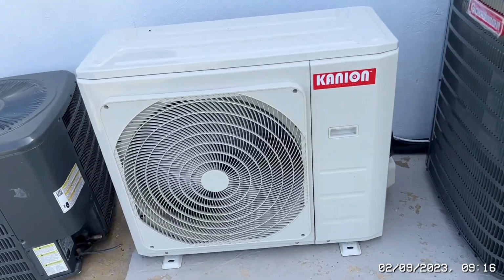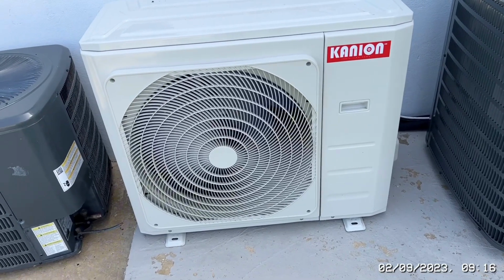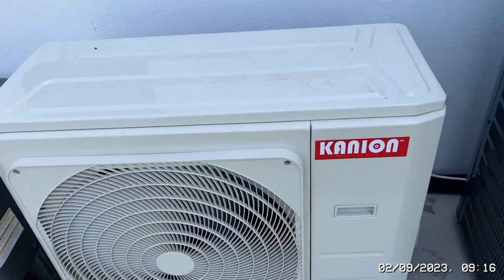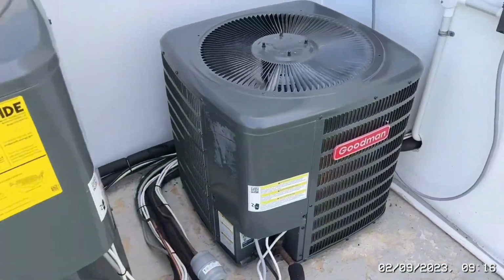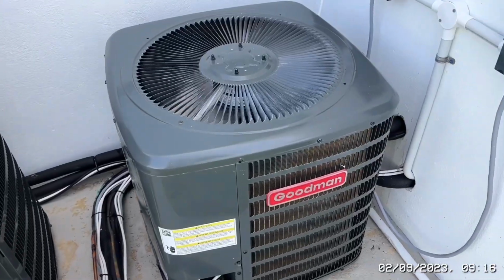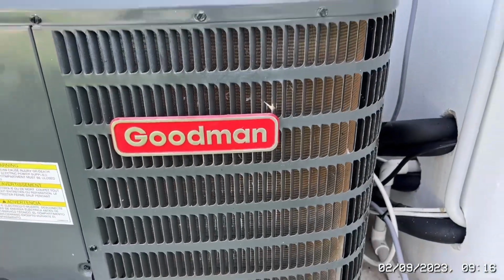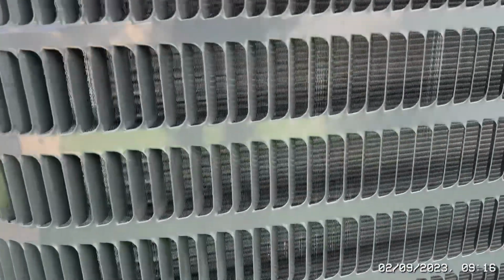This one's running the bedroom, as you've seen before, which is working really well. Word of advice, if you want my personal advice, I spray WD-40 all over my units and try to do that as regularly as possible, just to keep them defended against the salt in the air. As you can see, the fins on this one here are already going an orangey rusty colour compared to the silver they're normally meant to be.